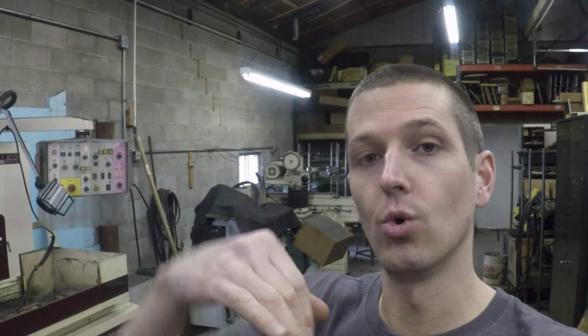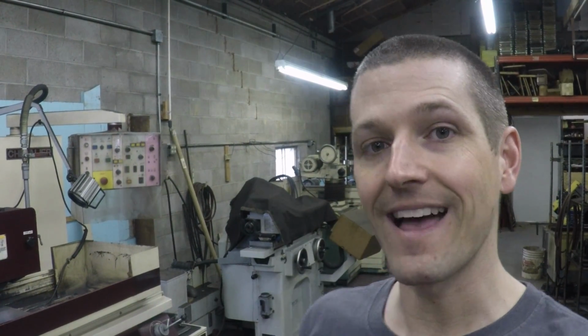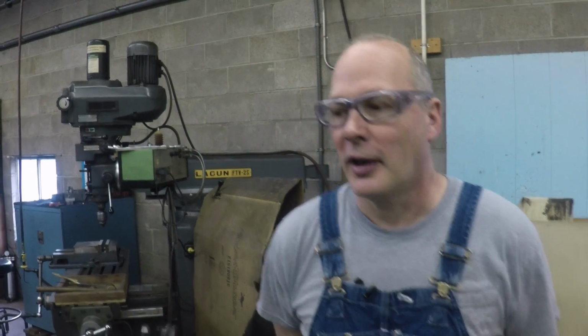And I've seen some of the VMCs that do the broaching. You can do things like an AR-15 magwell where it has a pointed tool and it can actually spindle orient. You drill out or mill out, and you're left with a radius, and the tool can orient itself and go in and broach out corners, just walking in that last little bit. Pretty cool. Yeah. And it gives you an added level of flexibility for stuff that comes in or some kind of weird jobs. Cool. Got that in the back of your mind.